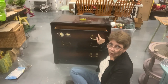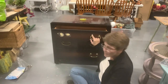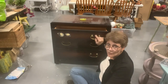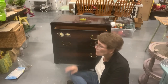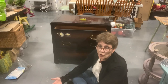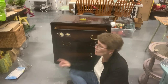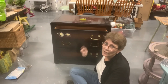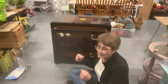What's the distance between the holes? Do I have something like that in my stash? Do I need to go and purchase something else? Always on old pieces, make sure that the distance is a really common distance. On really old pieces — this is pretty new so not an issue — but on really old pieces sometimes the distance is not common anymore, so you may be hard pressed to find hardware. So you need to know right from the start and do your hole filling at the beginning, not after you've gone through and done all your specialized finishing. It makes you cry later if you can't find pulls and you've got to start over.